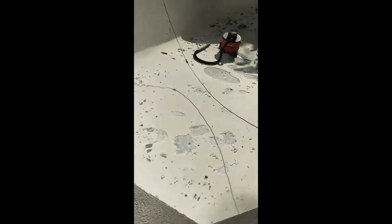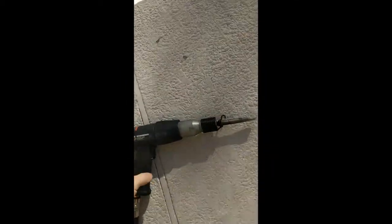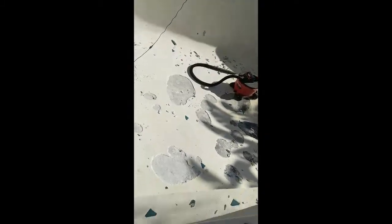To take off the top tiles, I used an air chisel — just put the chisel right on the top of the tile, hit it one time and they would pop right off. Whatever ones didn't pop right off that easily, you can just clean it up with a chisel. I got all the top tiles off; now I'm working on the bottom tiles.